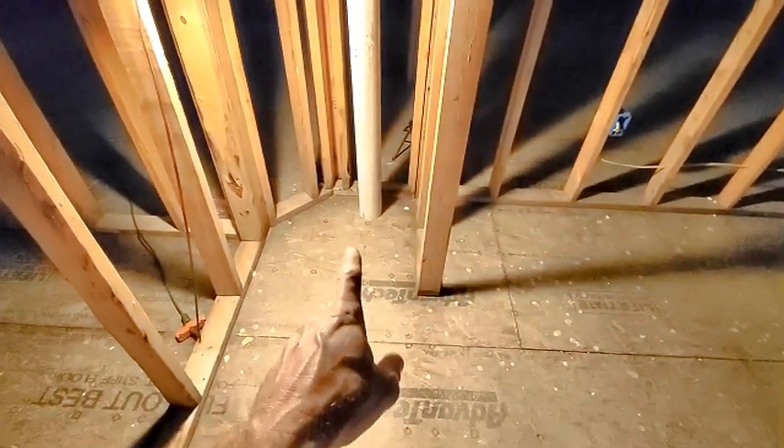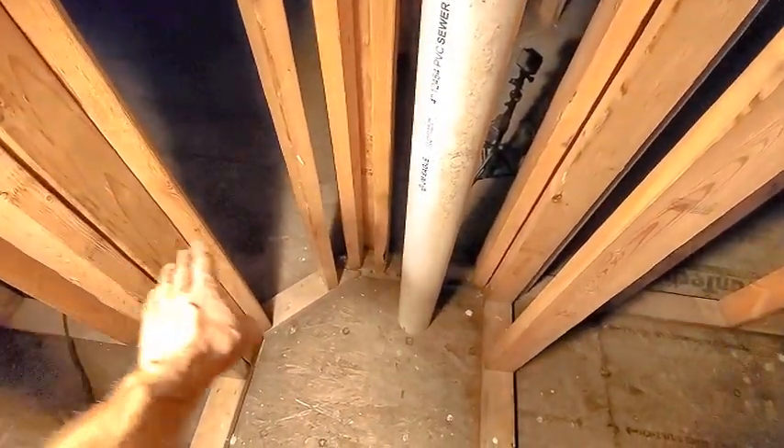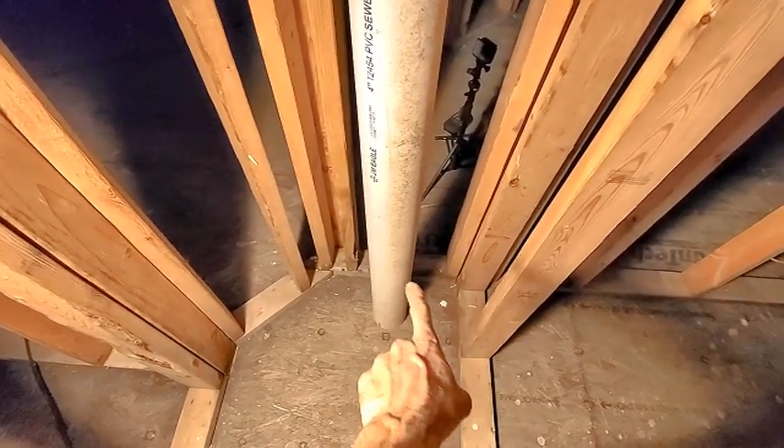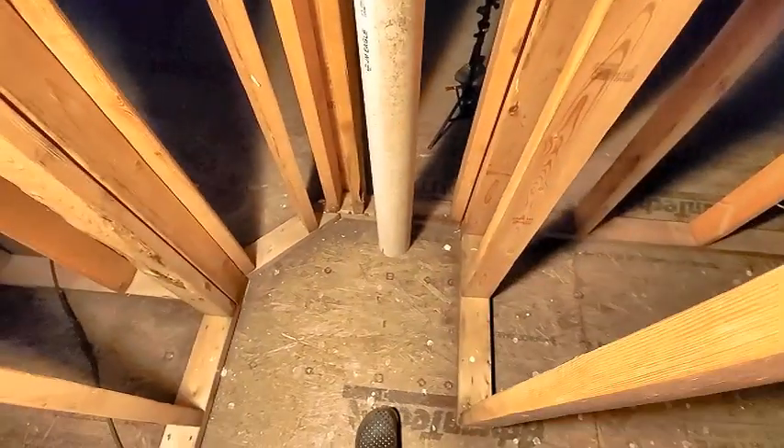I've got my ERV pipe - just a piece I've got going here - but down below the floor it's about right here. In this closet I've got this 45, I'm going to take this wall straight over and push this piece back in here. I'll drill my hole there and run this ERV vent up along the ceiling and down through here into the master bath.